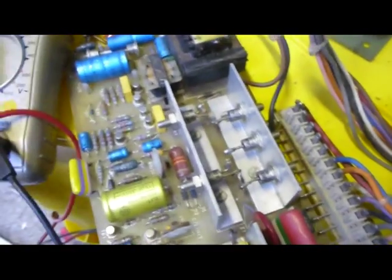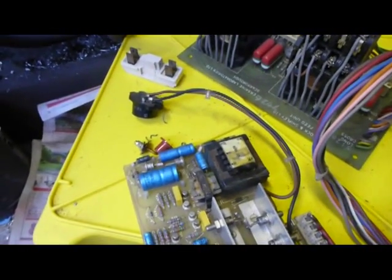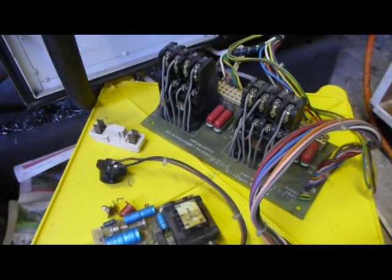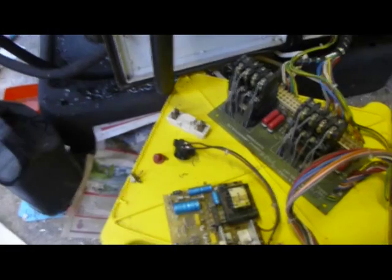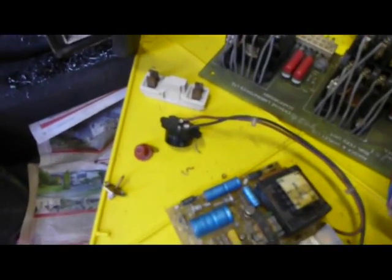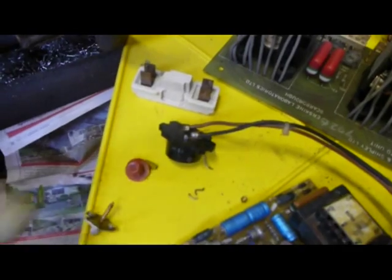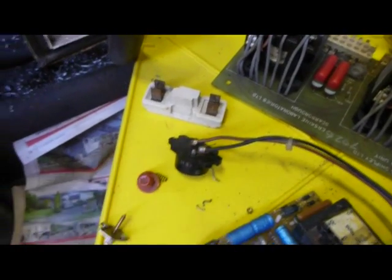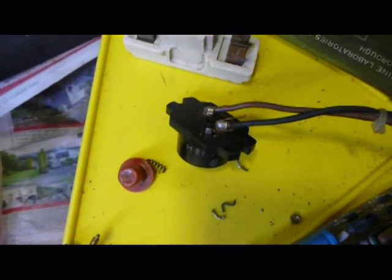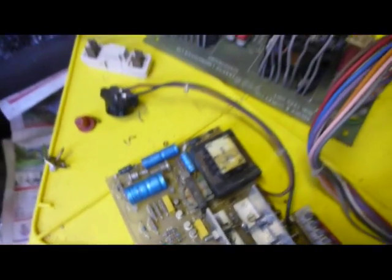What I might do is actually stay down here and we'll liven it up and see if we can get a closer look, obviously keeping our hands well clear. Okay, so we're about to liven it up again. We just had a quick look at the video, and the puff of smoke definitely came from this unit here. The fuse wire didn't blow, but we've made it a little bit tighter. It was a little bit loose. We've measured and we've got continuity again.